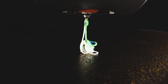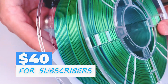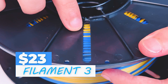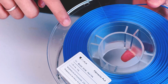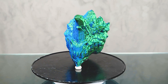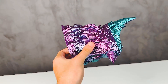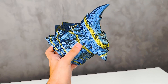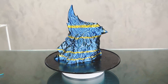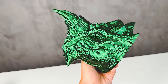To really test this, I bought a few dual-color filaments at different price points: the STL Flix one for $14 for subscribers, one for $16, one for $23, and the most expensive for $45. The STL Flix spool, which is easier to analyze thanks to its clear plastic, stayed perfectly consistent and gave a flawless transition through the print. The $16 one had transition issues, likely caused by poor winding that got worse toward the end of the spool. The $23 filament gave the worst result — inconsistent winding caused the transition to flip mid-print. And finally, the $45 spool gave excellent results too, with very consistent winding, just like the STL Flix one.